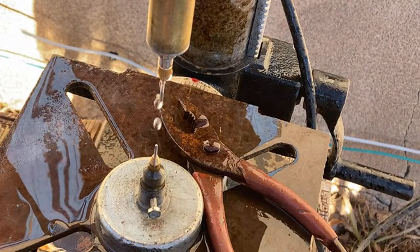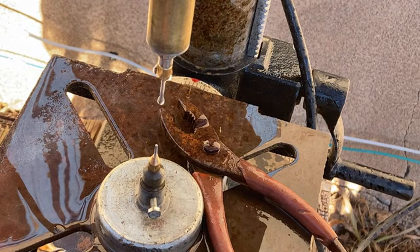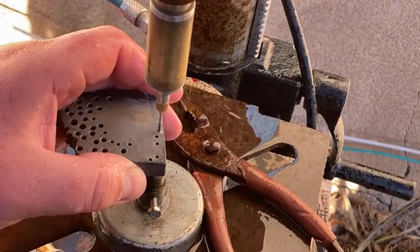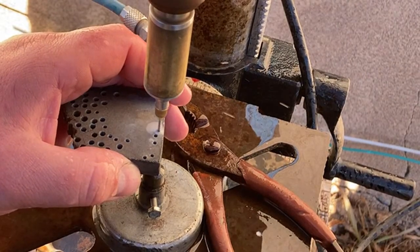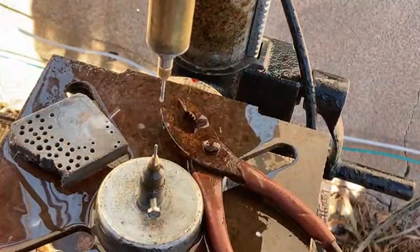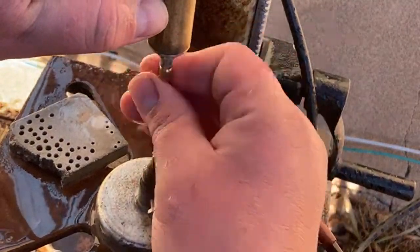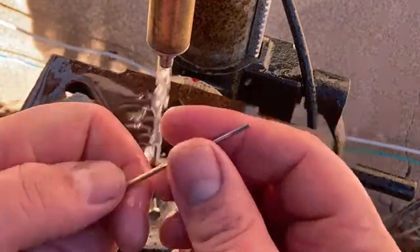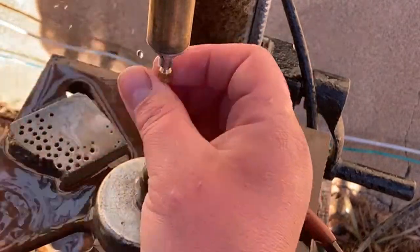And this is red jasper. I'd like to see anybody drill this by hand as fast as this machine is drilling. And I'm taking my time because it'd be very embarrassing to break a bit here on YouTube. All right, it's caked up a bit. That's something you got to realize. Don't think, oh, I just need to go another 0.5 millimeter. I need to go 0.25 millimeter. No, take it off. Show some respect to your burrs. Pop it through. Get the water going.